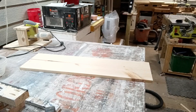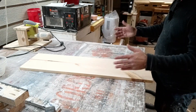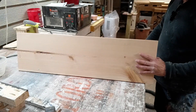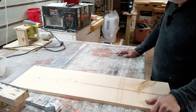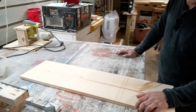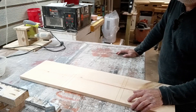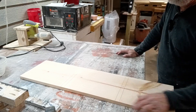These were six feet long, so I was able to get two sides for the three foot one out of one piece. I took them over to the sliding miter saw and cut them, and then I had to rip them down a little bit because they were too deep. They were like 11 and a half inches deep and she only needed 10, so I ripped it down to about 10 and a half just to give her a little bit more shelf space to the front.